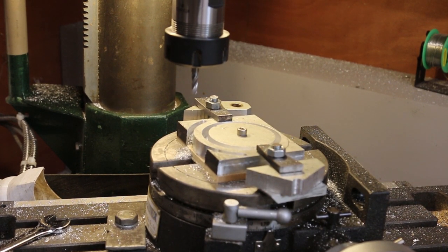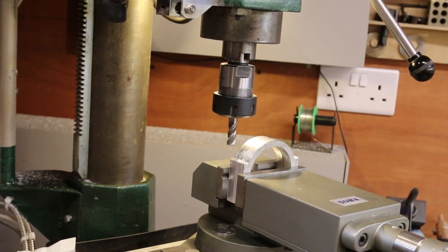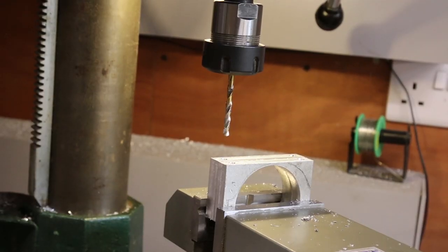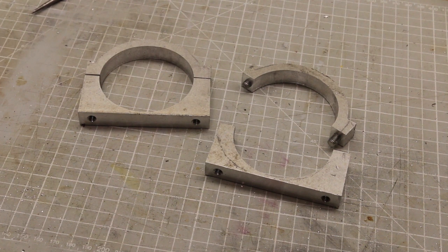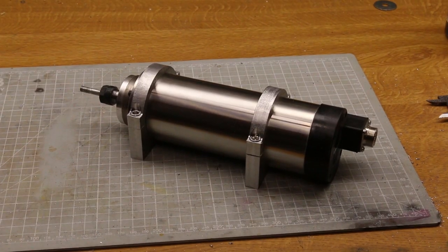As I've said before, I'm not a purist. Mounted vertically as a pair, I can now put the clamping bolt holes in. Drilled and counter bored, they look like this. Flipped over, the bases were drilled 5mm for the 6mm mounting bolts. The holes were tapped 6mm with the top strap still in place — this acts as a tap guide so you get well-aligned holes. The clamps are then separated and the bolts fitted. And here they are, fitted on the spindle.